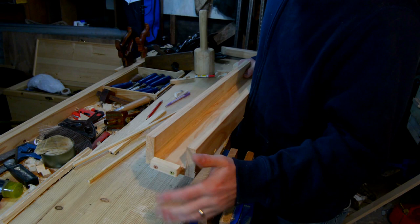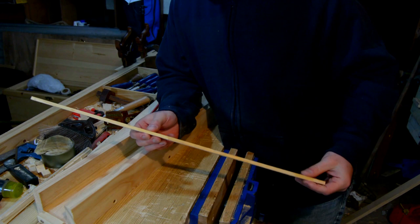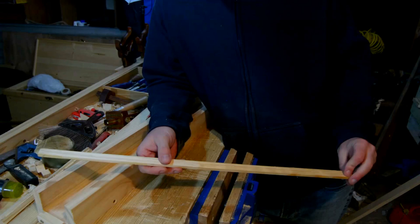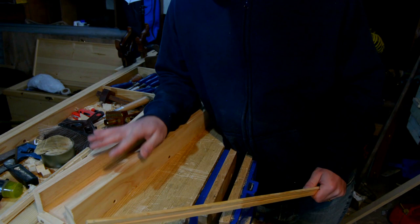The next thing you need to do is rip off a piece of stock. If I put these together, this is three-quarters of an inch wide minus my saw kerf. This is a quarter of an inch the entire way down. I planed this by hand and used a digital caliper to verify that this part is equal to that part — they're all equal. It really didn't take that long. Once you get used to planing by hand and using a marking gauge, you probably won't necessarily need something like this.